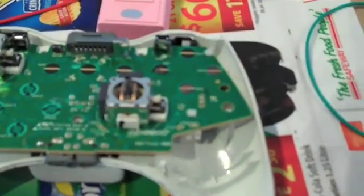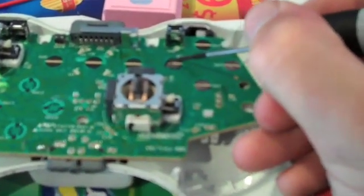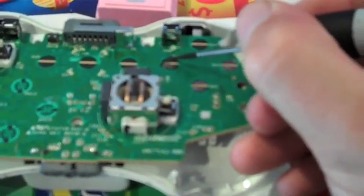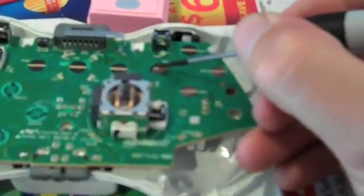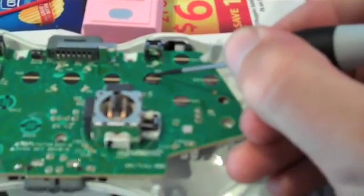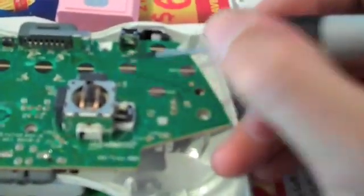Now I'm going to show you how to prepare the contacts. You need to scratch each of the black contacts off with a flat head screwdriver — just lightly scrape over the top and you'll see a powdery black residue start coming off, then just blow it off to get rid of it. You need to do that so you get a clean contact when soldering the wires on, otherwise you'll find you need to apply a fair bit of pressure to actually make a contact. It's actually pretty amazing how well those rubber contacts work — they make a great contact but seem to be really hard to solder onto.